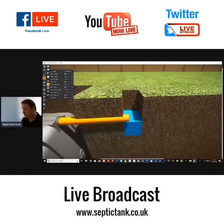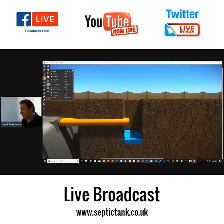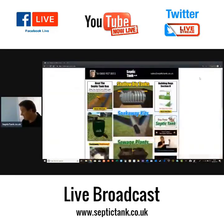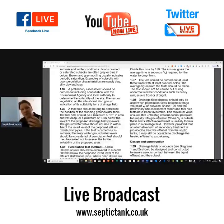To summarise: dig a hole 300 by 300 by 300 millimetres, fill it with 300 millimetres of water, let it seep away overnight. Next day, fill it again to 300 millimetres, wait until 25 percent has seeped away so you've got 75 percent left, start your stopwatch and time it from 75 percent down to 25 percent of its height — approximately 150 millimetres. This lets you work out whether your ground is suitable for a soakaway, what kind, what size, or whether secondary treatment is needed.